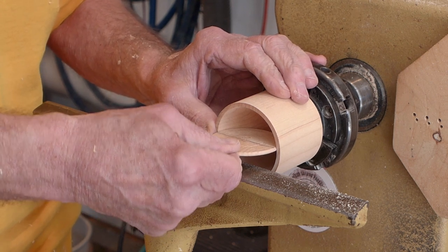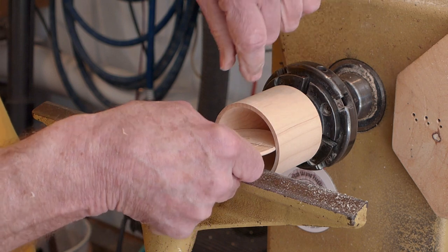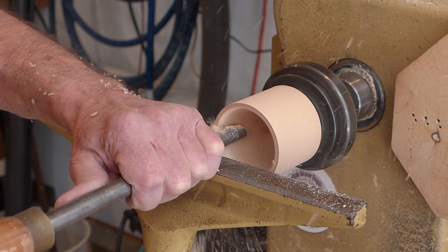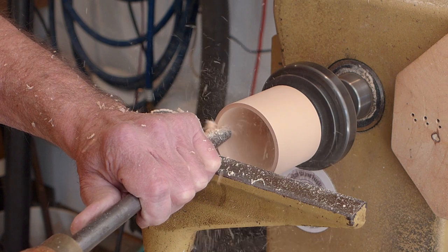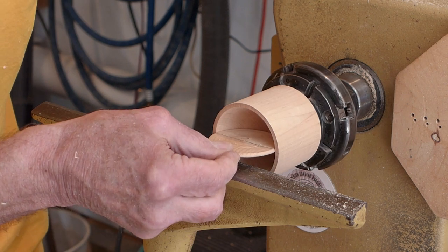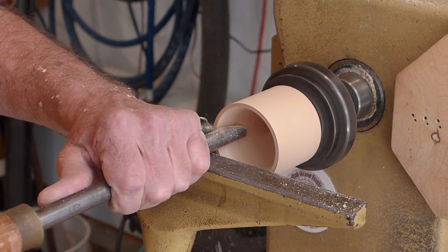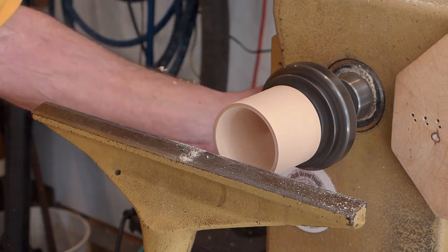Oh, it's getting much better. Maybe 3/32 of an inch to go. Hinge point now about 30 degrees in, and the depth is pretty good. So let's try for another 16th. Tapering out to the edge. Thinking hemispherically. All right, this hinge point, we're back at 45 degrees again, so let's scrub that away right in this area. Again, back and forth with that Ellsworth bump. Works.